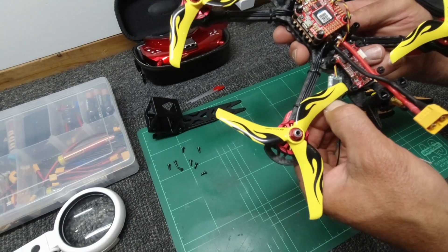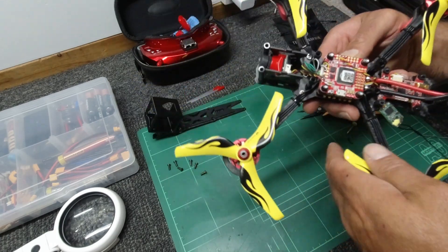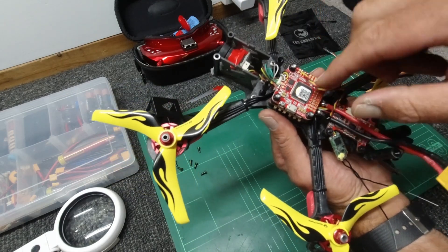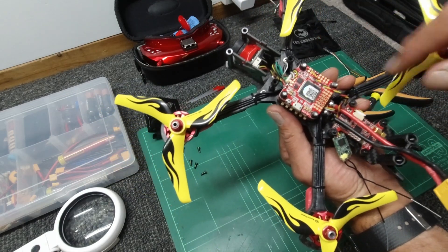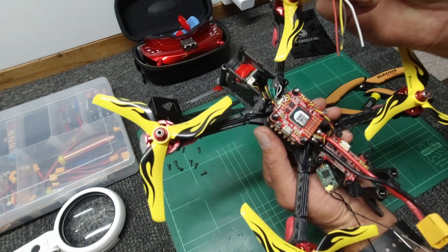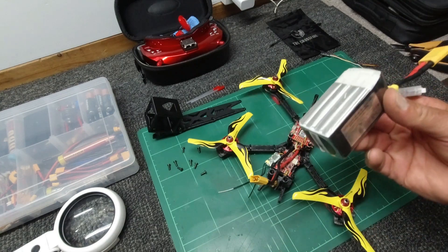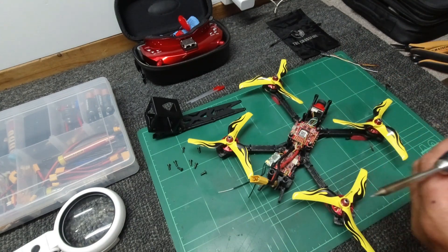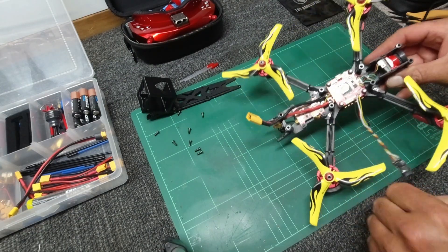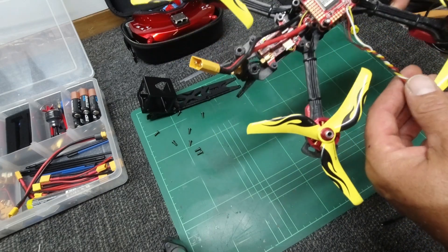There is our XM Plus exposed. I just need to desolder and pull it out. Luckily with the HGLRC we can easily access our solder points for the Crossfire, so let's desolder those and attach our new wires. Weapon of choice: the TS100 with a super fine tip — heats up fast, runs off your LiPo, love it. The connectors are all connected up to the flight controller: 5 volt, negative, RX, and TX.